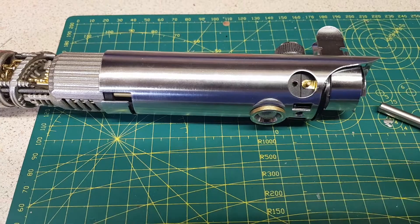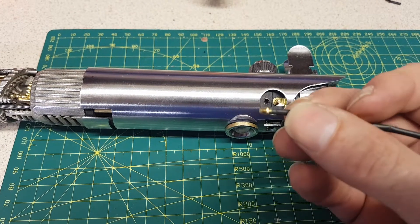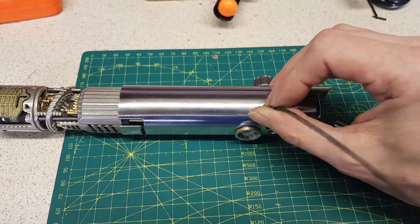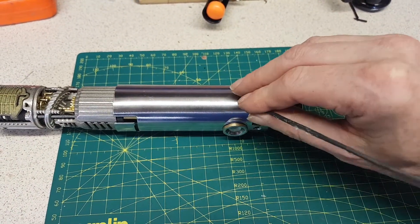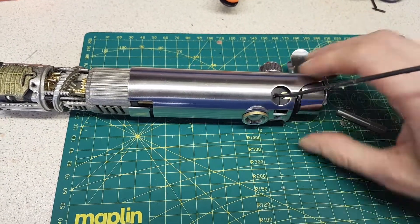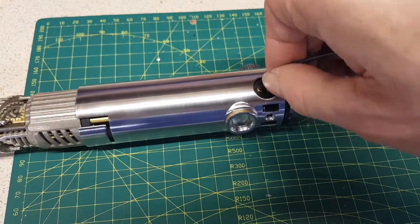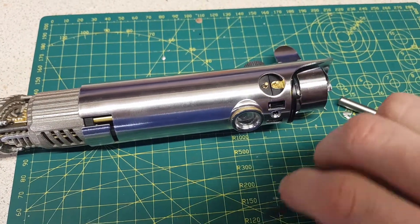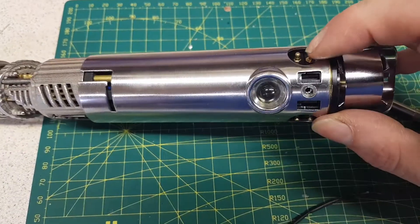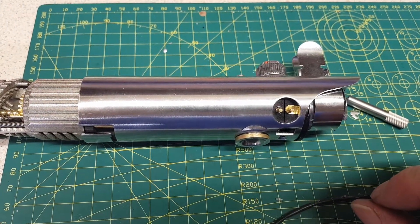I'll pause for a second so I can demonstrate — I'm holding the foam with the other hand. So all I've done is put the end of the pin in the end of the heat shrink, and this allows you to easily thread in the brass pin. A lot of people struggle with them, and the key thing this does is stop you from putting snipe nose pliers on the end of the pins and chewing them all up. It's now in there.